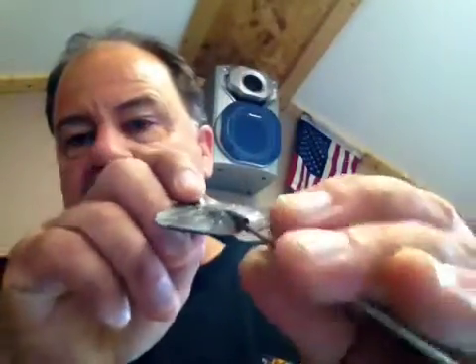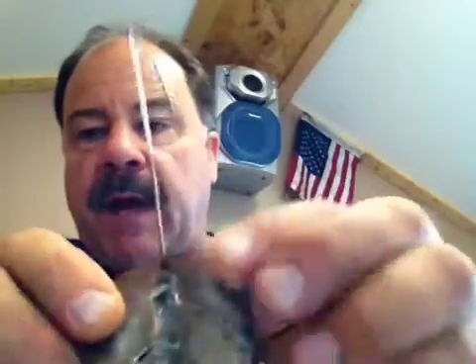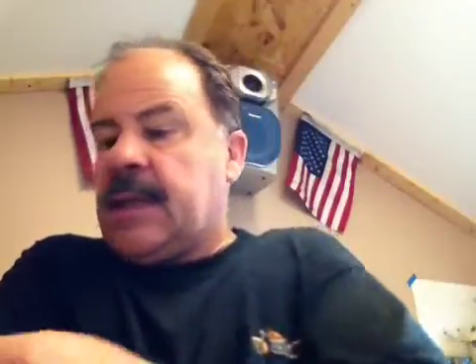Here's a leaf in a raw stage. This is just a piece of coat hanger and as you can see it's folded in half. I put the coat hanger in, fold it in half, then I open it back up and I'll weld down the middle and I'll weld the veins. Then I take it over to my log and I'll hammer it into shape. Like on the wine glass holder and that shelf, I spray painted them with barbecue paint and then sponge colored a little bit of autumn color on it.